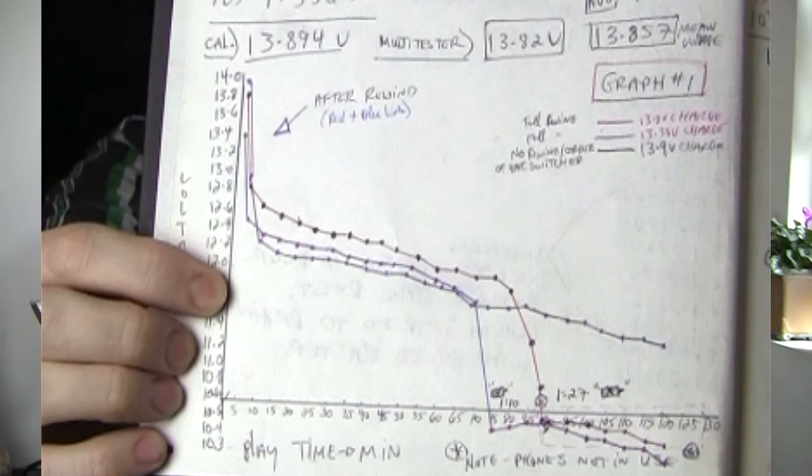You can see these trends — they never hit 12 volts for more than just a moment. So if you have higher milliamp hour batteries and your device has three battery bars to indicate strength, the first bar will drop quicker than with a primary cell, but the last two indicators will stay on much longer because of the high milliamp hour rating. So if you're going to buy rechargeable batteries, buy the high milliamp hour rating. The IKEA ones are eight dollars and have paid for themselves several times in the few months I've had them.